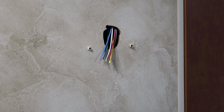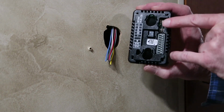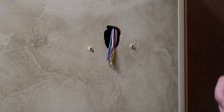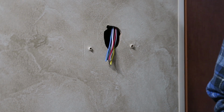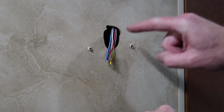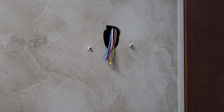Another thing that you might want to investigate is the size of this hole before you decide if you want to install a new thermostat. These are my mounting holes and they're just barely going to cover up that hole. And unfortunately it will end up with those two holes exposed, but I have access to a wood shop, and at some point what I'll do is build a big wooden block, drill a hole through it, run my wire through that, attach the thermostat to the wooden block, and probably put some keyhole hooks or something on that wooden block to make it a useful component.